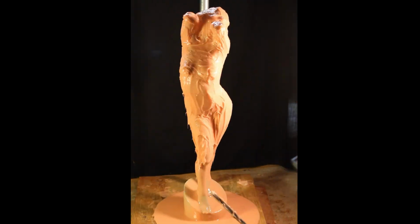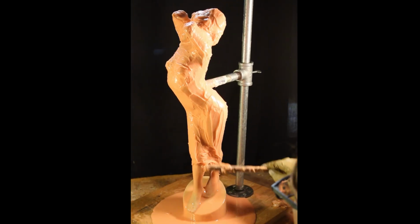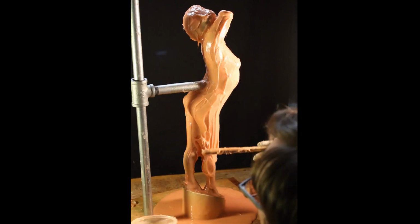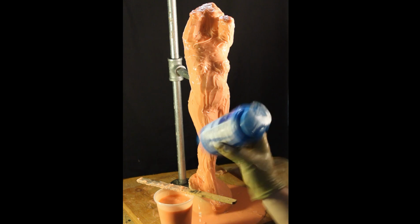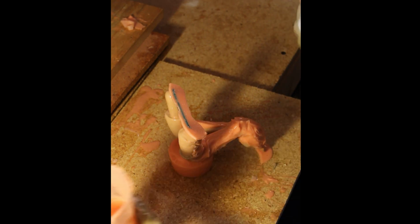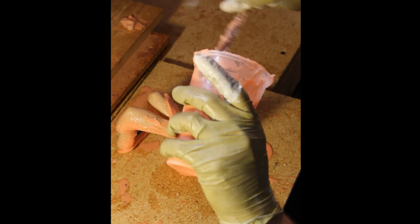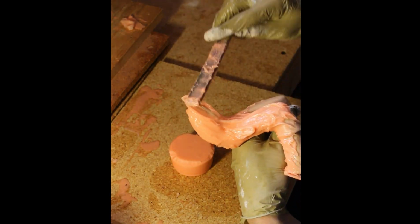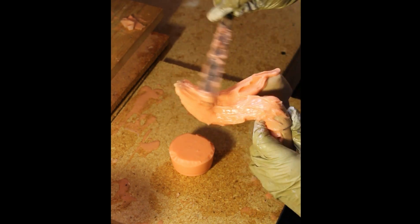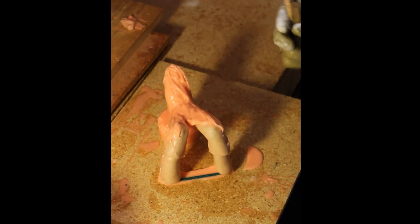Smooth it over, round out the high points, and make sure that those high points don't have hooks, because as you make your mother mold, that will cause trouble when you're trying to reseat it in the mother mold. Of course, if you do end up having hooks after the silicone is cured, you can use an X-Acto knife or any other type of sharp blade and just trim that back. Look it over between coats and make sure that it's as smooth as you can get it within reason, and get it ready for the next layer. In this layer here, I'm starting out by coating these arms.